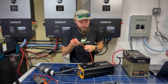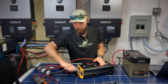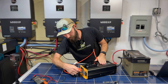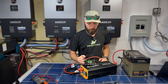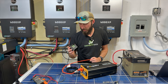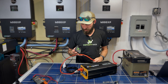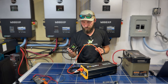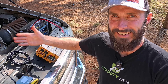One thing we can do is set up a test to check out the surge capabilities — see if we can run the air conditioner in here. I'm going to go ahead and plug this in. When I turn it on the AC is going to try to start up. I'm showing 600 watts output. It must have had a surge though, because it's an air conditioner — when that compressor kicks on it has a pretty high surge. It's actually running the air conditioner in here, very smoothly. This thing seemed to handle it really well.